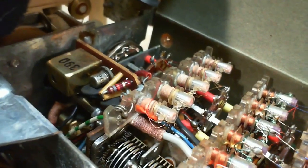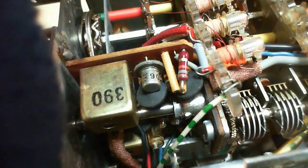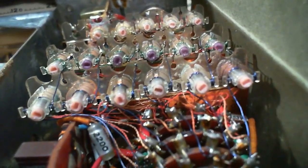Now there's a chance that when you align this radio, you start with, let's say, the AM band, and then the alignment takes place with a sort of, let's call it a master trimmer. You're trimming the master local oscillator, if I can put it that way, it's not the best way to put it. There's only one local oscillator in here. But having made the first adjustment, all the rest ride right on top of the first one. Now, I don't know how true that is, but remember when we were checking the bands out, they all seemed to be out a similar amount, which made me think there's some singular factor. And that would be that master thing. So we'd be looking for another trimmer capacitor. Certainly not that thing.